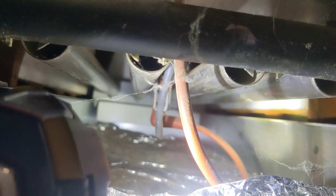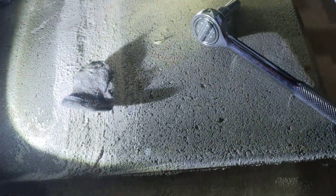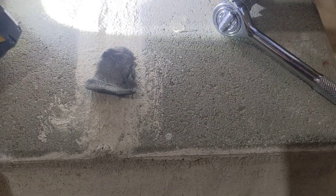I can see the ceramic and the parts of it. I'm going to pause this and then we'll try to clean the flame rod — just going to use some fine steel wool to clean the residue off it. There's the pilot assembly; you can see the two spark-plug-looking objects there. Underneath the green wire, in the center of the frame, that's the flame rod.